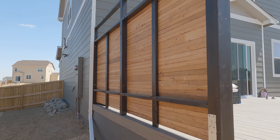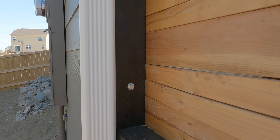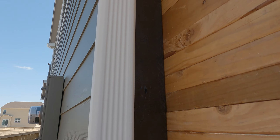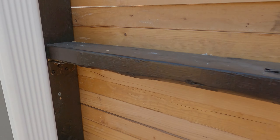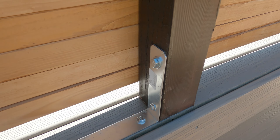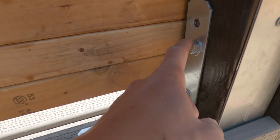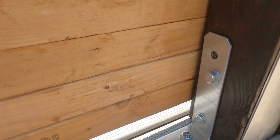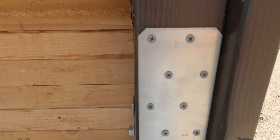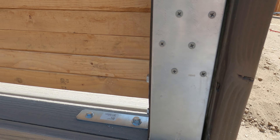With my neighbor's help, I had a very small window to get this thing installed, so I unfortunately did not have the camera rolling. Here you can see we used long zinc lag screws to attach the wall to the side of the house. I also used metal L angles to attach each post to the top of the deck using zinc screws. This spot actually broke one of the screws when I over-tightened it, so I had to drill a new hole and install a new lag screw, but it turned out good.